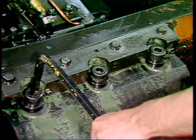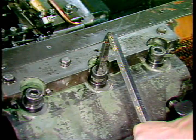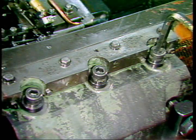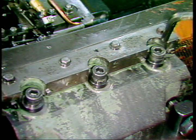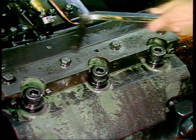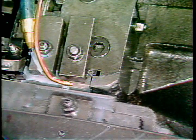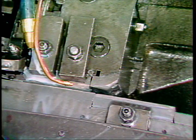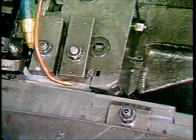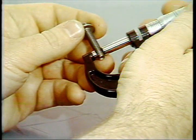The fine die squeeze adjustment is done with the slide housing lock screws snugged down. To be sure the lock screws are just snug, first loosen them, then re-tighten using light pressure. Jog a blank through the dies. Handle newly rolled blanks cautiously — they may be hot as they fall from the dies. Allow the blank to cool, then measure the major diameter.